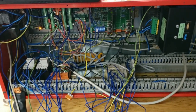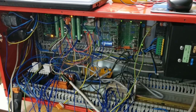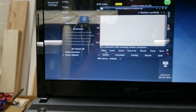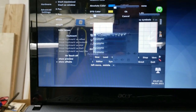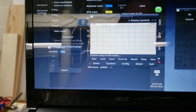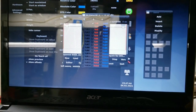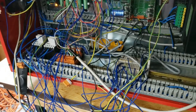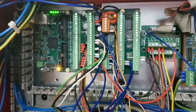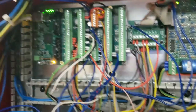I've got some good news and some bad news. The good news is I got the turret going. The bad news is I have to figure out how to make it actually turret. I've got a couple of pins tied in Classic Ladder so far, and if I just go in, create a virtual relay, output zero, go to my VARs, and toggle that, you'll see I get turret rotation. The spaghetti mess hasn't gotten any better. I realized as I was hooking up my turret board that the 7i76ED does not help me in the case of requiring a sourcing output.